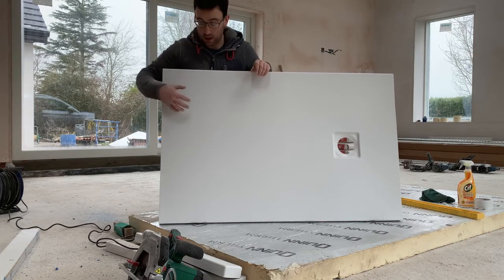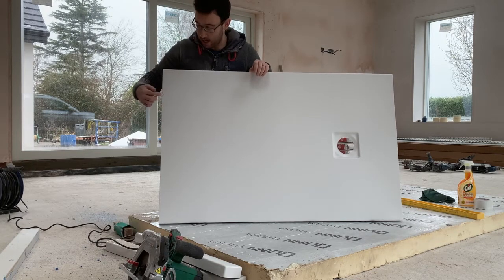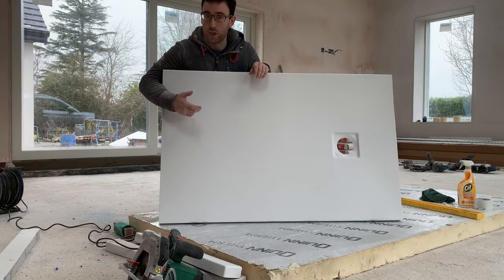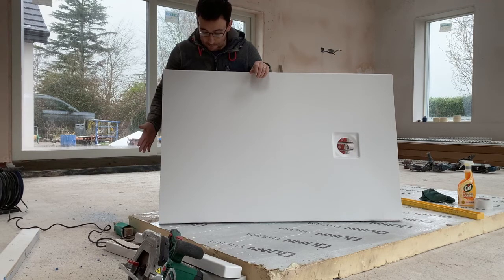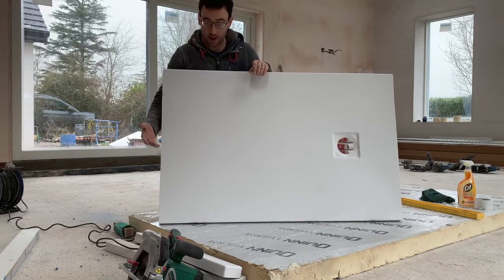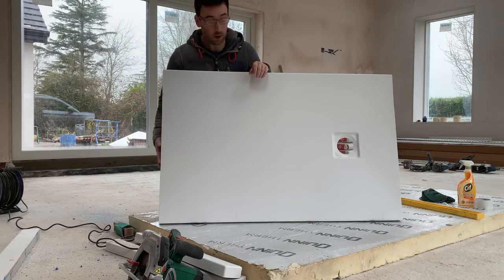There's also a section where the fiberglass broke away as we were cutting — about 10mm. Our tile is 8-10mm thick plus 3-4mm glue, so it covers that completely. If you're leaving the tray surface exposed, you could try epoxy to fill it, though colour consistency might be an issue. These trays also have an anti-slip texture option for about £70 extra per tray. If you have a track saw, use it — it gives better edge support. We had a fresh blade in our circular saw, which is as good as we can do.